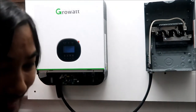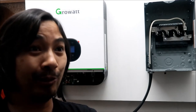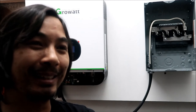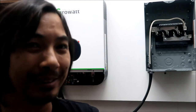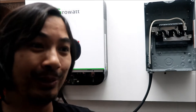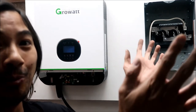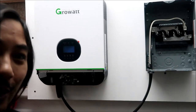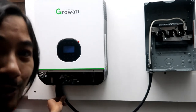Everything is connected. How well connected — we'll find out if it gets too hot. The terminals on the Growatt inverter look kind of fragile — they're plastic, but I understand why: so stuff doesn't short out accidentally. Six-gauge wire is the correct wire they recommended, so hopefully there's a good connection. I know for sure there's a good connection on the panel box because it's a lot more open and easier to work on. I did the continuity test to confirm everything is connected.